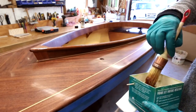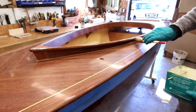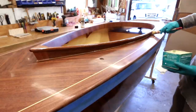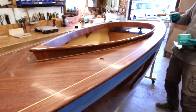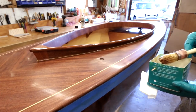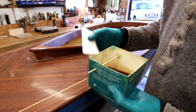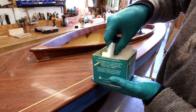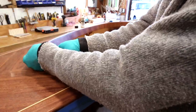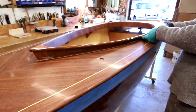What I'm doing right now is feeding some varnish up underneath this lip here. I'm not worried about my brush strokes or anything at this moment — just laying that varnish on. I've got plenty of working time with this varnish. And now I've got a little bit of shop rag — a clean one. I'm just going to dip a little bit of it in varnish and pad on some varnish to get up underneath that lip. This is a technique you can use — people don't think about it very much. You can't put the varnish on as heavy when you're padding, but you can still do it.